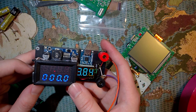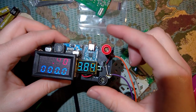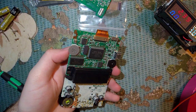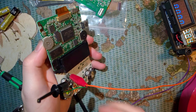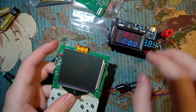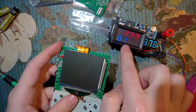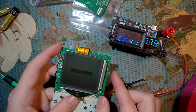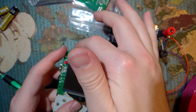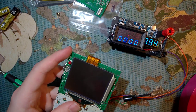I gave my power supply a few upgrades here. I desoldered the original potentiometer and threw a thumb wheel on it, and then I drilled some holes and put some banana plug sockets in there. Much more functional now. Stock, no game - if you adjust the contrast you can even get better battery life, but at an unusable level of contrast. It's about 80 milliamps on 2.4 volts.